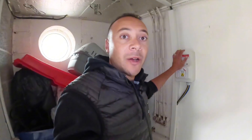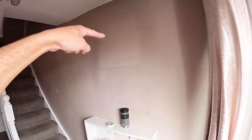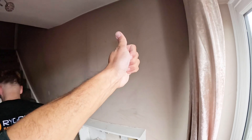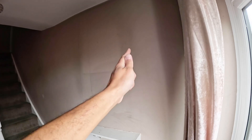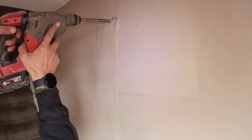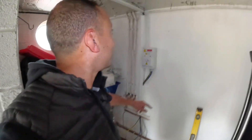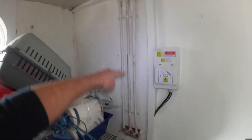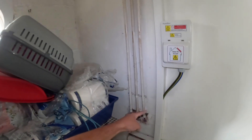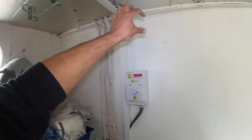We've got Jake on the scene. Because we're going to be popping through here, we're going to excavate some of this wall so that the cables that run up we can pull them out of the wall. That way when I drill through from the other side of the wall, I won't come through into the cables - because the angle of the drill from the other side is going to be low and coming up high on this side. I can't do it from this side because I won't get the angle on the drill. These cables are in conduit - we're going to get rid of these conduits here and trunk it across, then it'll trunk down to our new board. The cables come down, drill through the wall as existing, so we'll pull back, chop these off at high level, and then come straight across and into our new board.